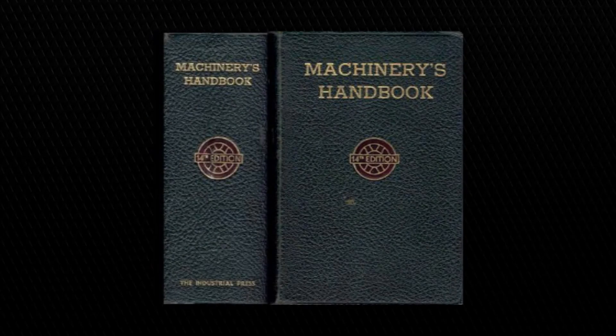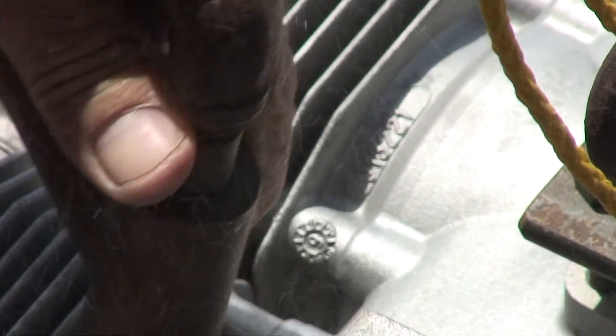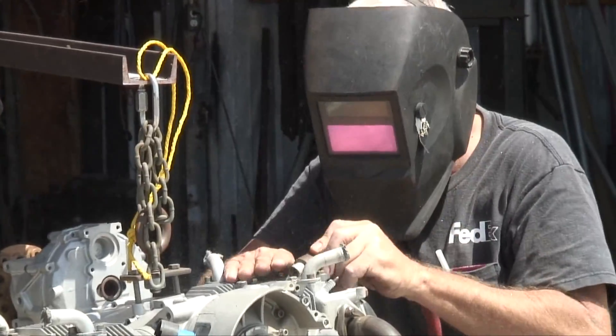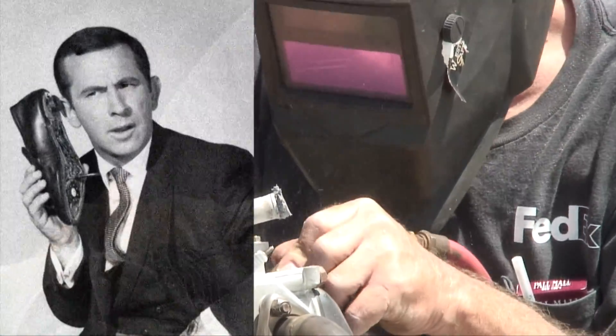In the days when I first started buying glass beads — probably 25 years ago — the machinery handbook had a list of glass beads from 1 to 13. I've been using about a mid-grade number 7, except for some very meticulous little dies for stamping coins. For those we had to go to a 13, which is super fine for cleaning before plating. Now I start calling around asking for number 7 beads from manufacturers and nobody knows. They've got an ABC system now — basically three grits — A is fine, C is more coarse. They may have more than that.